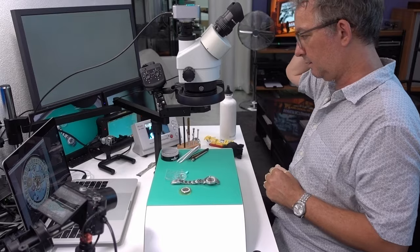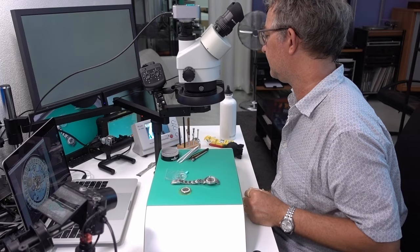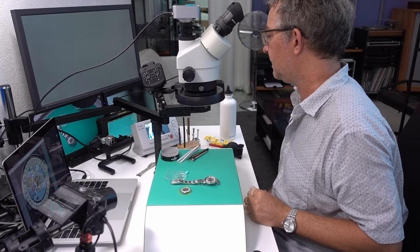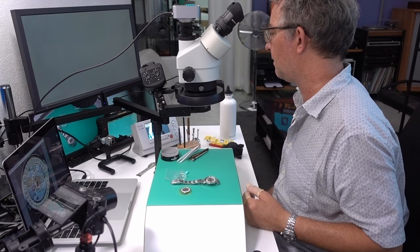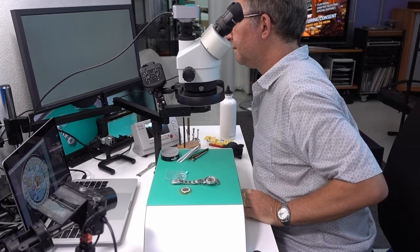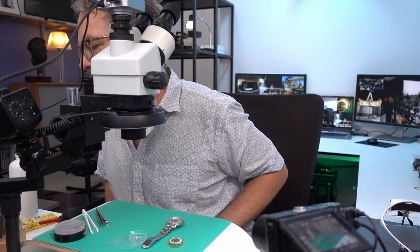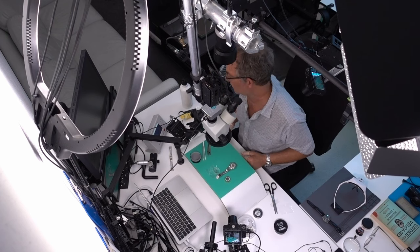The amplitude is now 179. It has the correct beat rate of 18,000. Amplitude is 189, and it's losing 200 seconds per day. Beat error is 1.2. It says it's losing 216 seconds per day, which I think would mean that something is slowing it down.